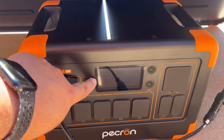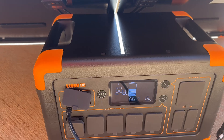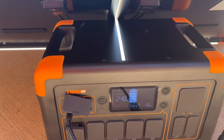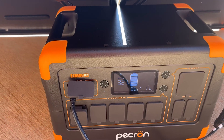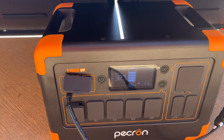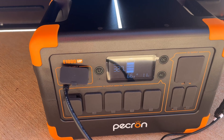The screen dims really fast, but it's going to take about an hour and a half to charge up. There are no clouds, so that should be pretty good — it might even speed up a little as the sun shifts. I said this was my 300 watt panel, but it's actually about 360 watts I think. I went ahead and kicked it up to 20 amps and I'm getting 327 watts in now, so about 1.1 hours. We'll let this do its thing and be back.